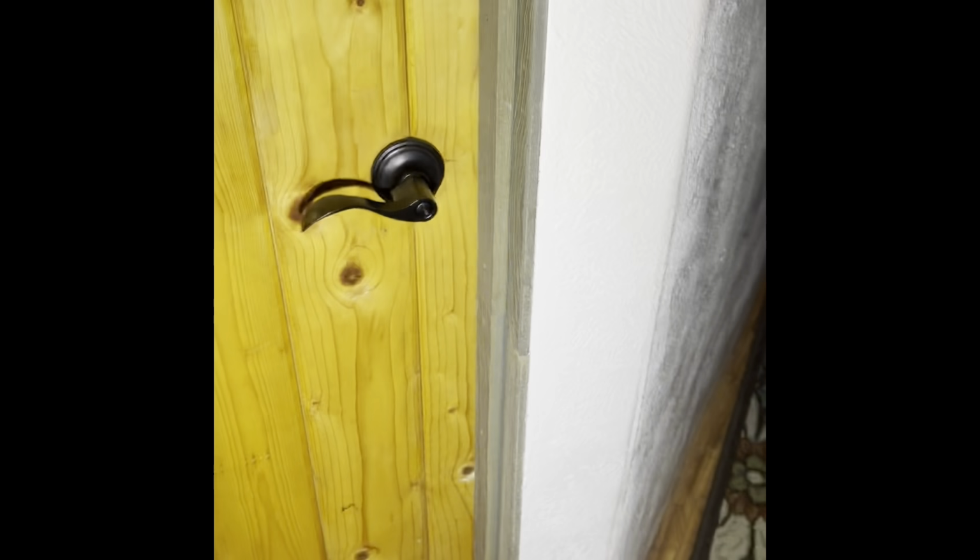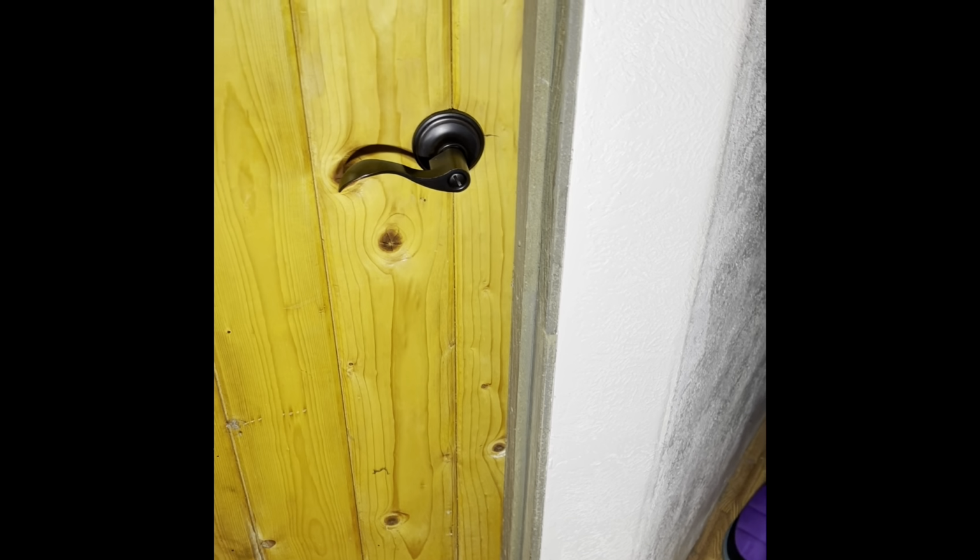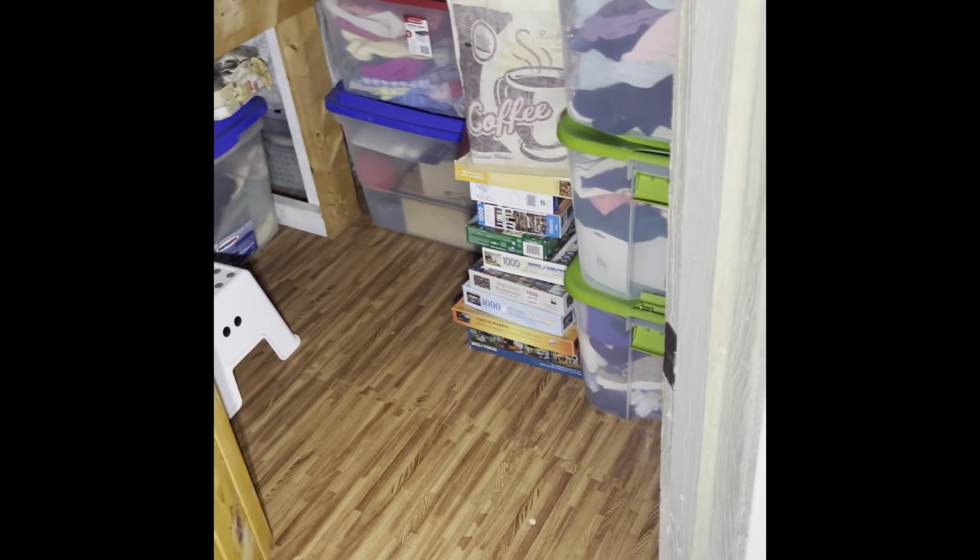And then I got the same material I use on the doors. I use that up above on the loft area. It's 2x6 tongue and groove spruce. And that's how I do a lot of construction. A lot of guys use that because it makes it finished. Other guys will build floor joists and plywood, and then they put something on the ceiling like sheetrock, but this is way more finished, and it's a beautiful look, and it doesn't hold moisture. It's really nice.